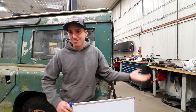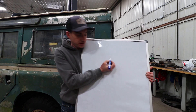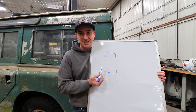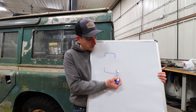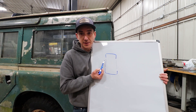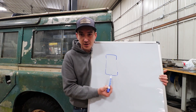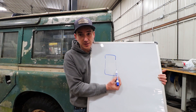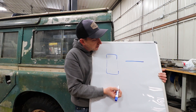There are a bunch of different ways we could go about doing this, but this is how I'm going to go. We'll get out the handy whiteboard here. What I'm going to do is bend up two U-shapes essentially. We have our tube cut into 10 foot sections, so we're going to take two of those tubes and start from the center out to bend, with some legs left over. We'll cut up some lengths out of our remaining tube and make up the length difference for however long we want. We're going to start off with these two — probably about 56 inches or so from center of tube to center of tube. Then once we get our length figured out, we'll slide some slugs in between these and weld all those up. Then we will have our flat roof rack — just doing a single layer on this. Once that's all made up, we'll have our crossbars welded in, then our drops on the side that go down to the drip rail.